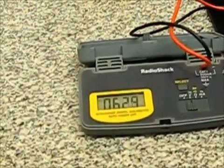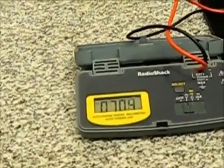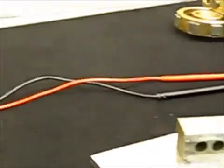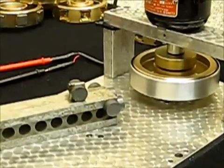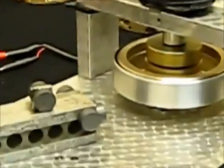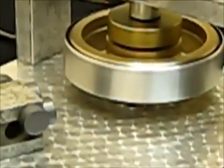As you can see, we're up to 60 volts now — 62. It just keeps climbing and climbing as the motor progressively gets faster and faster. Before, we had an accident where it got so fast that the magnets actually started flying out. That's why we've encapsulated them with the aluminum band.